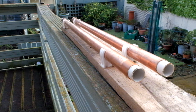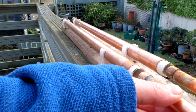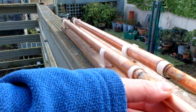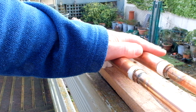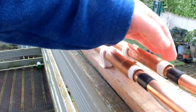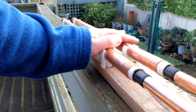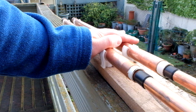As you may have noticed earlier when I put the 15 millimeter pipe down inside the plastic tube, it wobbled about quite a bit — it was a pretty loose fit. And that loose fit can make the capacitor unpredictable. So I've put these 15 millimeter stop ends on here; as you can see it's still a little bit loose but nowhere near as loose as it was. If you don't want to use stop ends, you can put some black tape around it so that it just fits inside the tube.